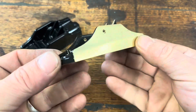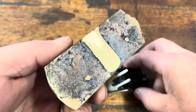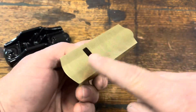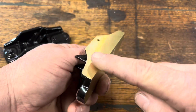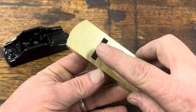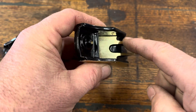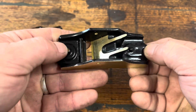Here's our finished body — all machined. It started out pretty rough from casting. First we machined the sole flat, then squared the sides up to the sole, then opened the mouth, machined the seat for the iron, drilled the hole for the pinch pin, and tapped for the tote and the knob.